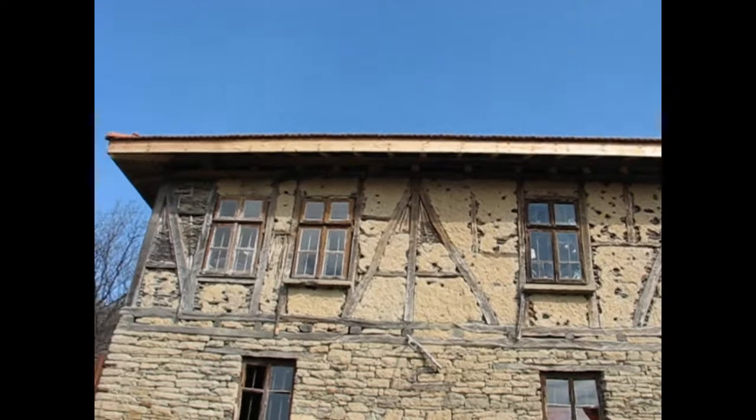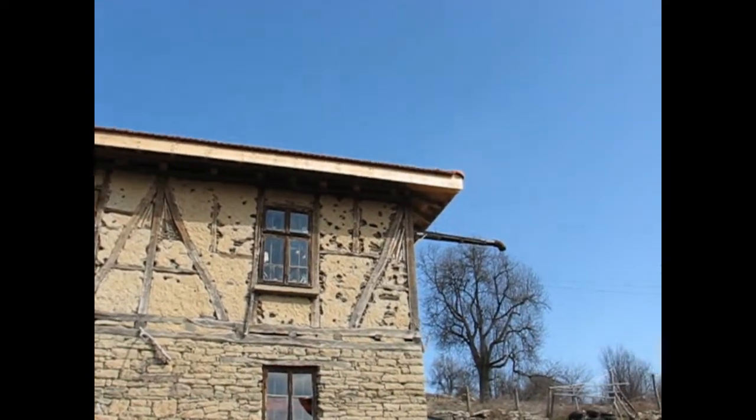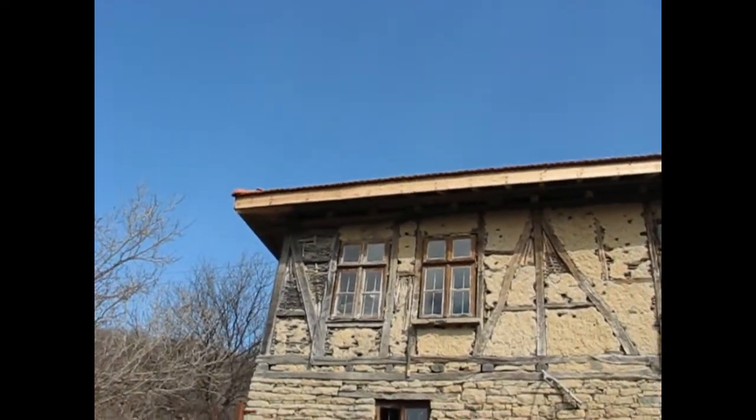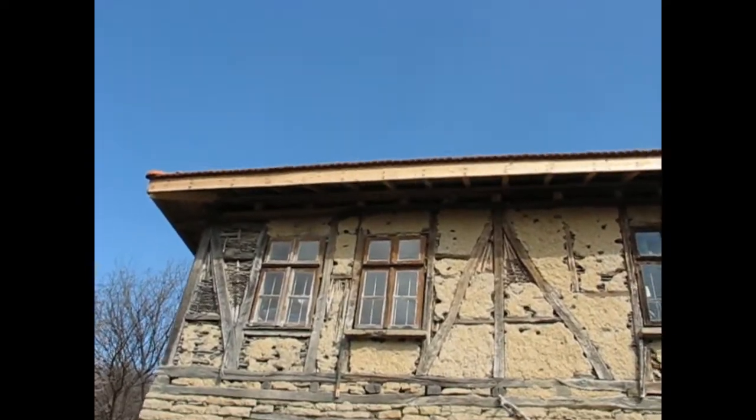I'll move further away and look at the fascia board — I want to see that it is perfectly level with no rotten places. Before going onto the roof, an attic inspection is a must. I've had situations where I've actually almost fallen through old roofs, where you step somewhere and suddenly a batten breaks under you, a bunch of tiles go down, and you find yourself halfway down up to your waist. You must always inspect the roof from the bottom before you climb on top. These are old roofs here in Bulgaria — many of them are over a hundred years old. You just don't know what you're walking on.